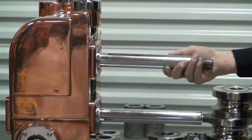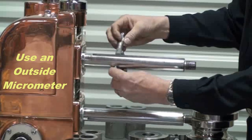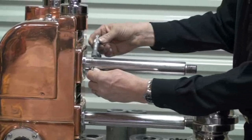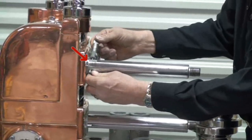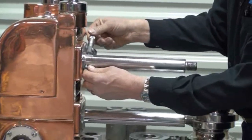Check your shaft to make sure that we don't have any big lines or deep grooves in there. We can use a micrometer to check especially where the roll is, as that's where the most wear is going to be. We can check right up here by the shoulder where normally a spacer goes, so that we can see exactly what the original OD of the shaft was.